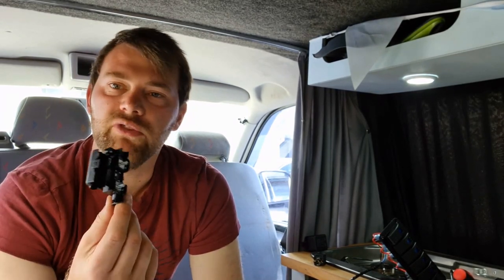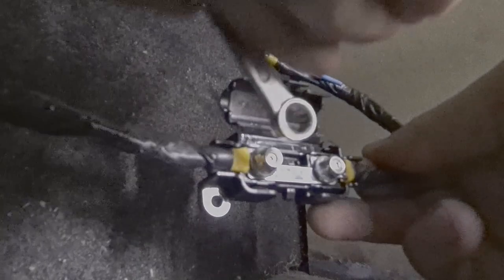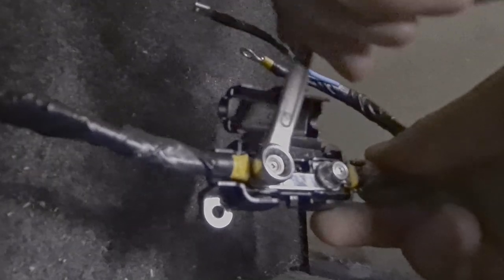I've got a 100 amp fuse, which is going to be going right in by the battery where the cable for the inverter comes off. So it's going to be fused. I've not actually ever had this main cable fused since I've had this inverter. The inverter's got fuses built in, but the actual feed itself isn't fused. So I'm going to be fitting this to that cable just to make it extra safe.